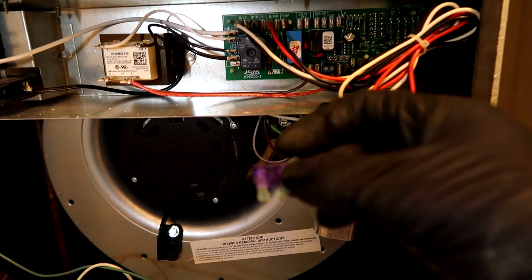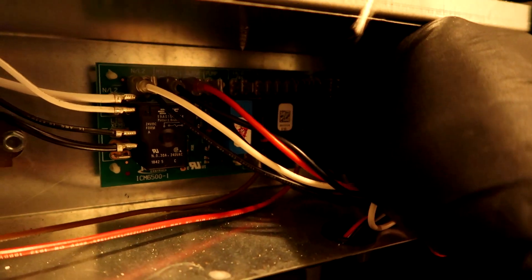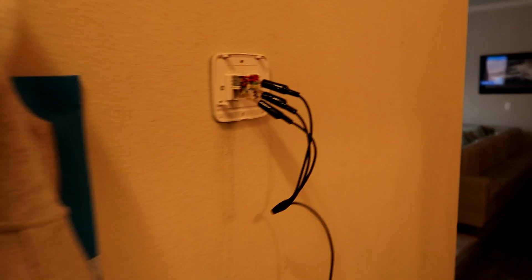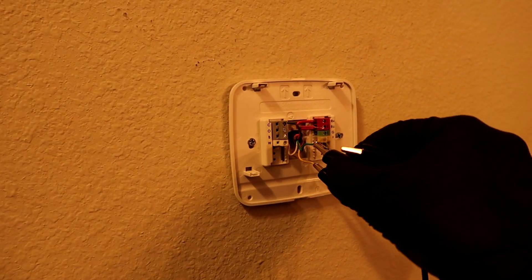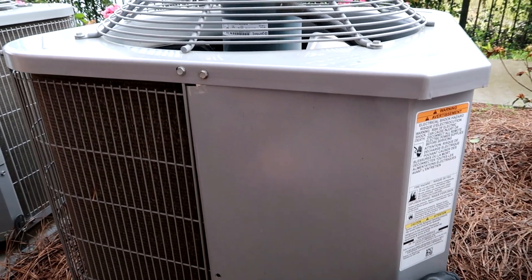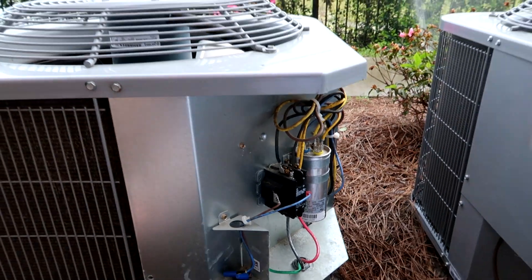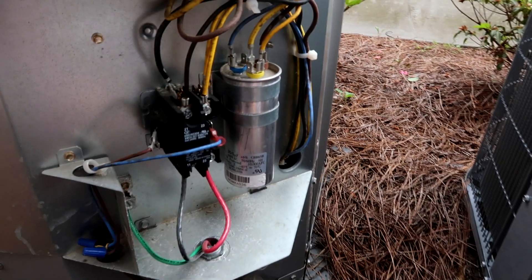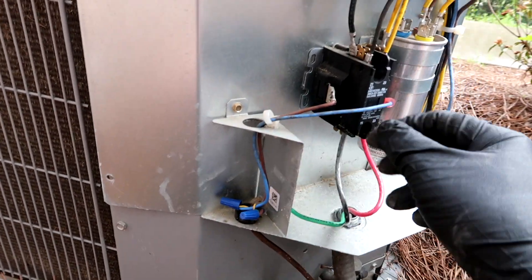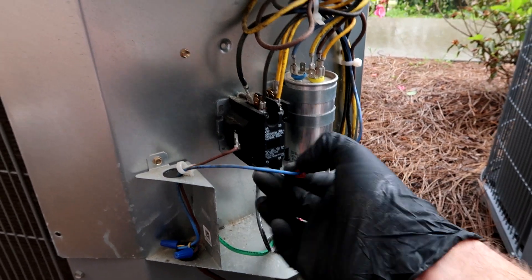That was the original call — the fuse blew. Now it's still good, but wow. Let me go outside and check the contactor before we go any further. This is really weird. I went outside to see if the condenser was on and it wasn't. I came in and said, whoa, something smells like it's cooking. There was no issue until I introduced the yellow wire — that's when I started smelling the burning. When I just had green and red the fan came on with no issues. Let's test out the contactor.